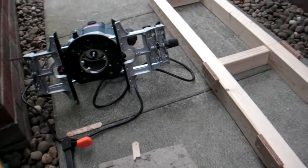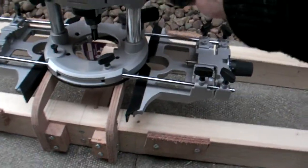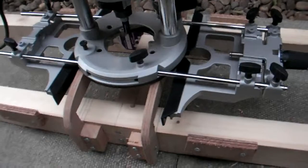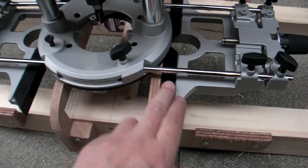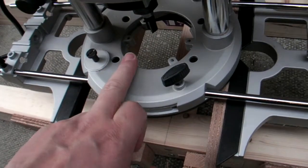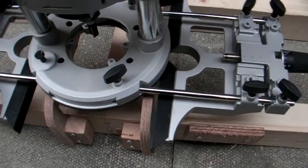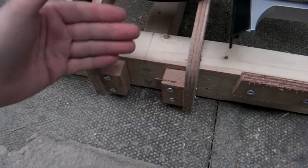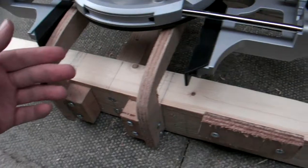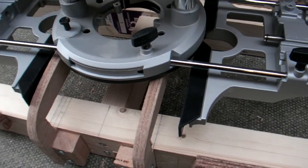I've set up my router to do it, and the basic idea is that you put that on there like that. You put the guides on the side so that the base stays on that profile there, which gives me about a 30mm side-to-side motion that I can use to machine the board. When the router comes down here those are vertical, so at the nose of the profile you just machine the vertical surface, and when you turn the other side you get the reverse mirror profile.